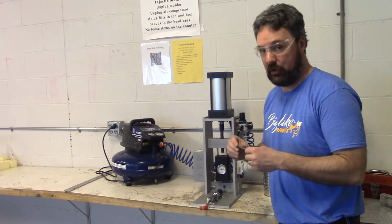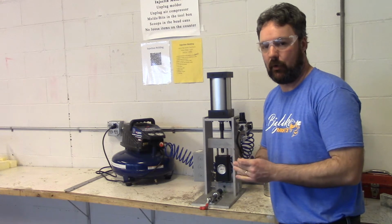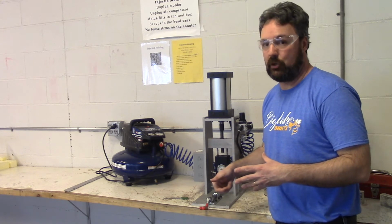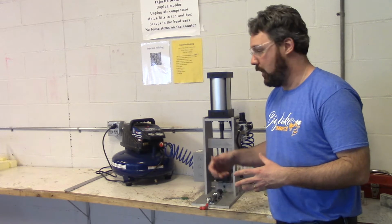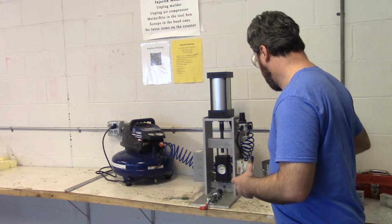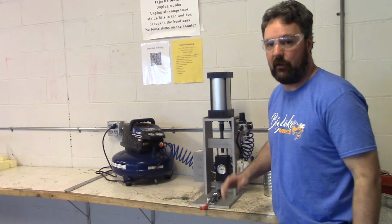You're probably not going to notice much on a piece this size, but as we get bigger we'll see we have a little bit more grip with low density polyethylene. If I'm going to make a golf tee, that golf tee needs to be pushed into the ground. If it's cold outside, if the ground's tough, a low density golf tee is going to bend. A high density golf tee is going to be able to push into the ground better. So today we're going to make a golf tee out of high density polyethylene beads. So let's see how this process works.